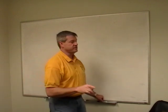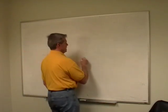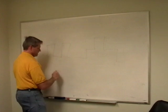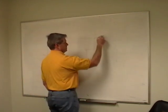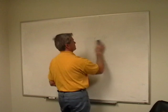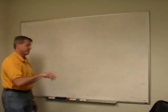We noticed that in driving CCDs, you don't just have to deal with a voltage on and a voltage off, right? We noticed that we wanted to do a stair-stepping of our voltages. Because if you remember the drawing a few minutes ago, I wanted to go from plus plus to plus to minus minus. And so there's these transitions. And so that means that we have to get clever in our driving circuits, because now we need three states, well, four. We have off, we have high, we have medium, and we have low. So we've got four states that we have to push into to drive the device.